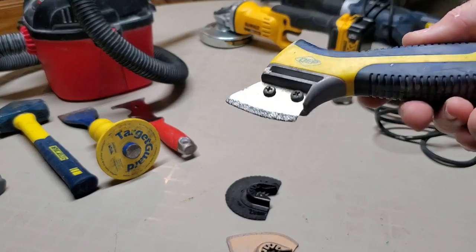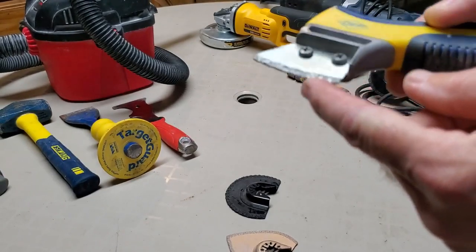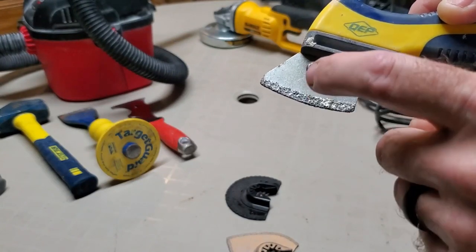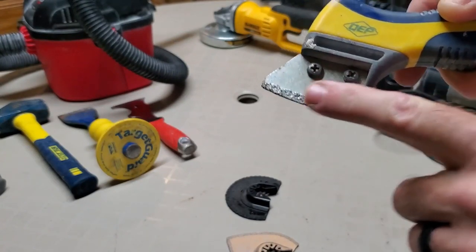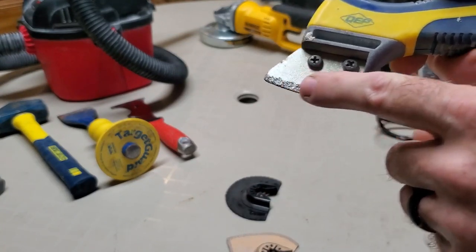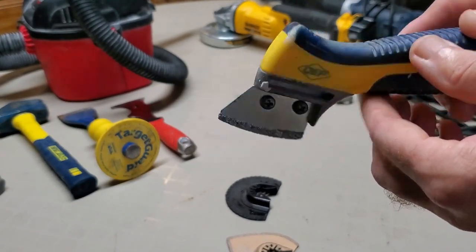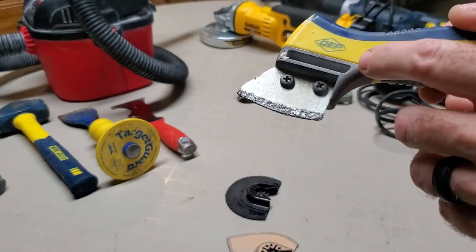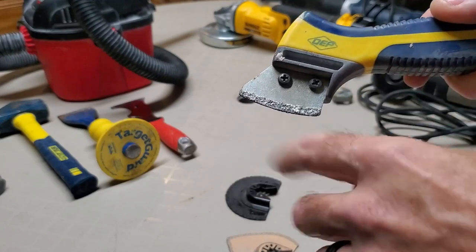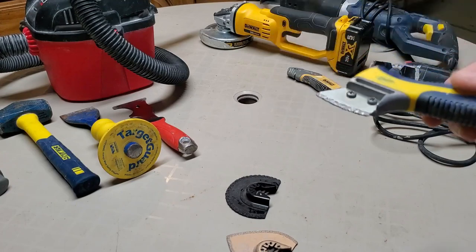Another method is to use one of these. If you're only doing a small area, you can use one of these grout removal saws. I'm going to talk a little bit more about this. The replacement blades come in a two-pack, they're like $3 or $4. You can buy this at Home Depot. There's another version of this available at Floors and Decor, made by other companies. You can also buy one on Amazon. I'll put a link in the description below. But this is a good system if you're only tackling one tile, or just a short grout run, because obviously it's manual. So that's another system.